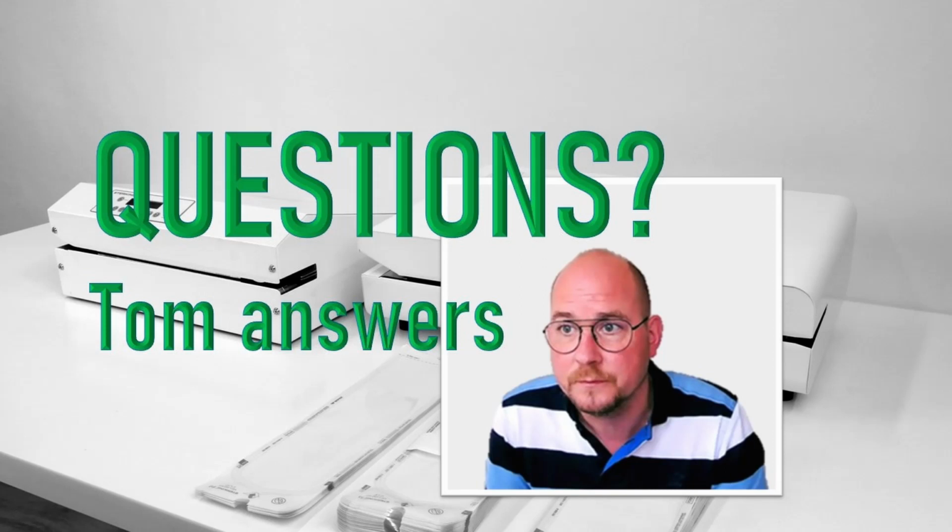No, we would not recommend that. What you see when you measure with the infrared thermometer on the heating bar, the heat on the heating bar can vary quite a lot from the beginning, from the middle to the end of the heating bar. So that's why we put this extra aluminium measuring block on top of the thermocouple to measure exactly at that point. You could, if you find a sweet spot, but we recommend really to measure it with a wire.